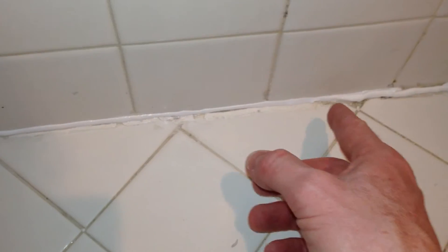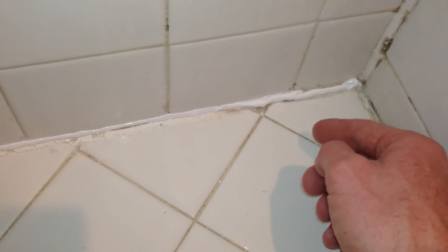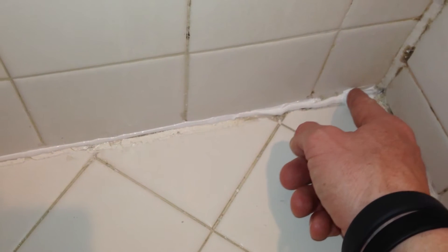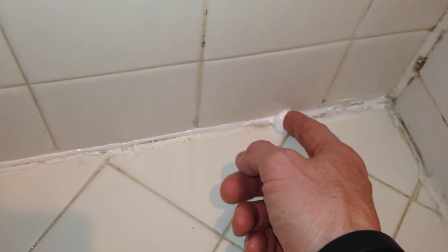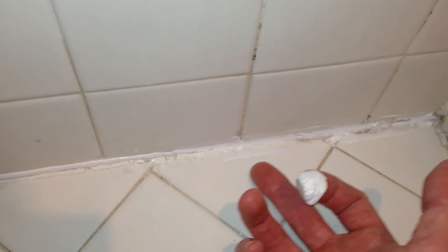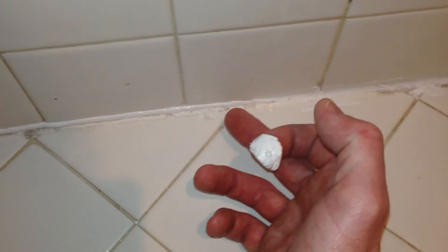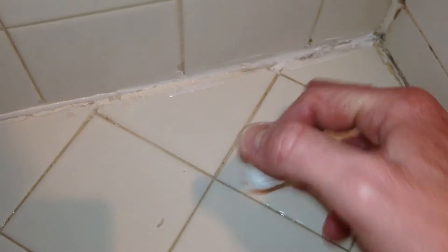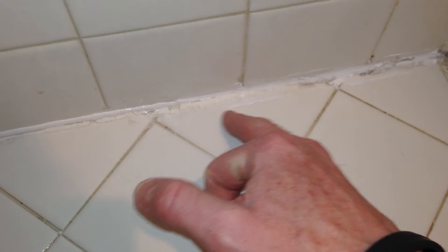What I did is I laid on a nice little thin stream. Now how to get it even — I have a little special technique where I use my middle finger or pointer finger and just push it down and guide it along the edge. You're going to get a big clump going, but it's going to get right there in the edge. Then you just clean up this mess. It goes on nice and smooth right in that little corner. Have a paper towel and a washcloth handy so you can wipe it off your fingers and clean up before it dries.